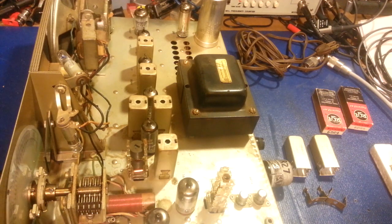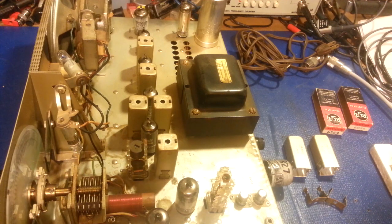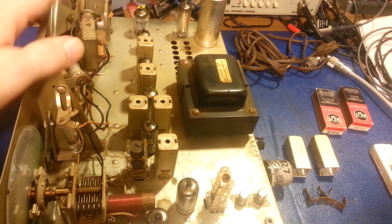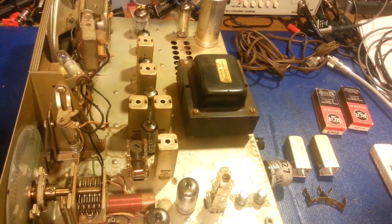With the tuning capacitor at its full clockwise rotation - past channel 23 - it can just barely pick up channel 6. So it's way off frequency. It was deaf though, could not hear anything on air. Once I realized how far off the frequencies were, I put my signal generator on channel 1 and was able to hear it. I went through and did a by-ear alignment of all the IF transformers.